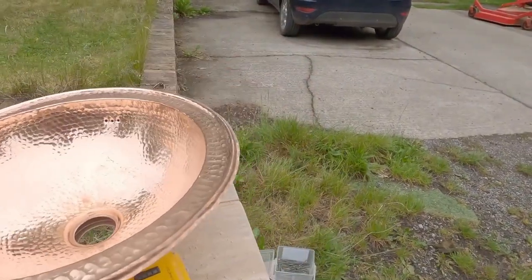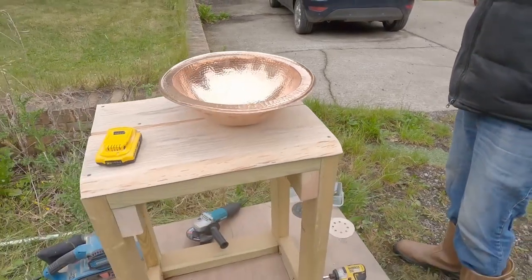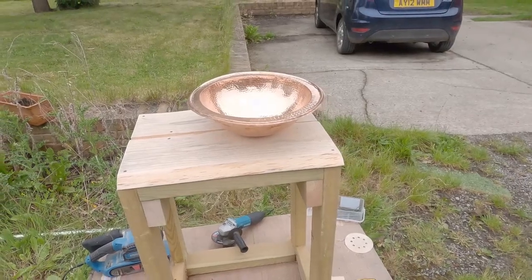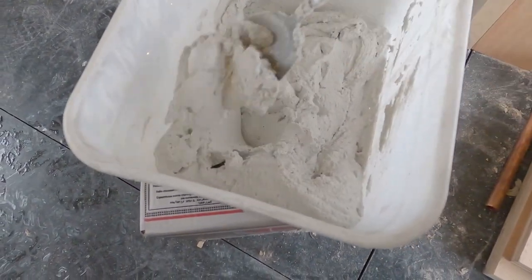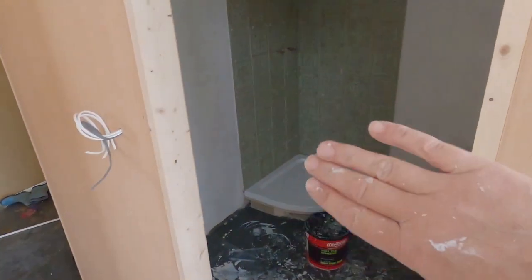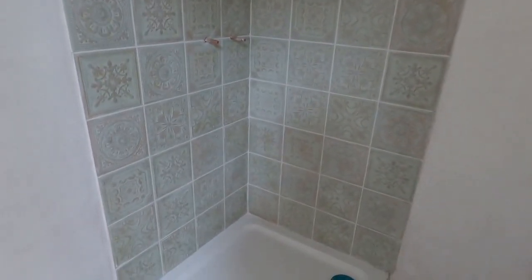The framework is taking shape — the front still needs finishing but that's that, and there'll be a tap coming up and over there. I just need to varnish it now. I've come to grout — I mixed up my grout and tried to add a coppery pigment but ordered a sample pack instead of a real pack, so it made no difference. I'm going to grout all the tiles and then try and get the vanity in. There's something really satisfying about grouting — and now I'm going to work out where I need to tile around the vanity.